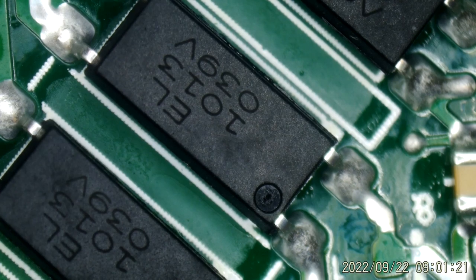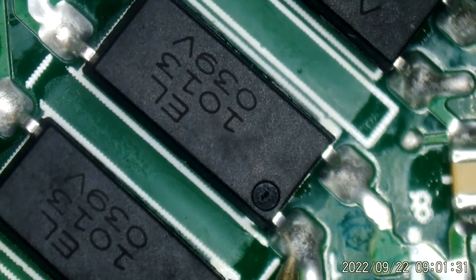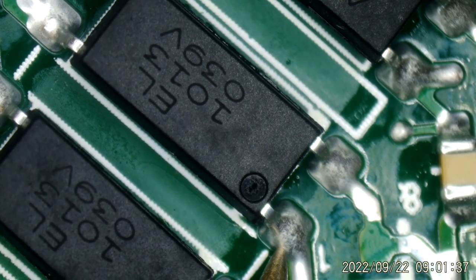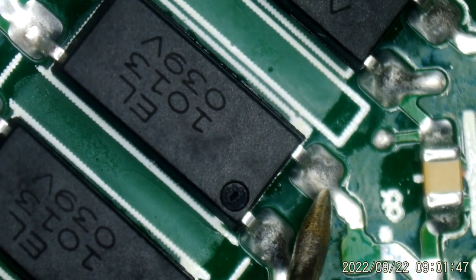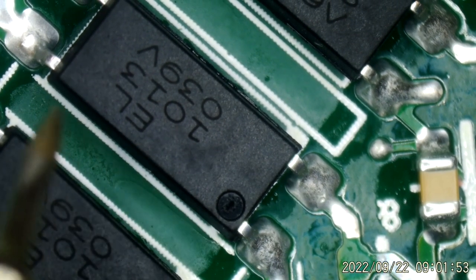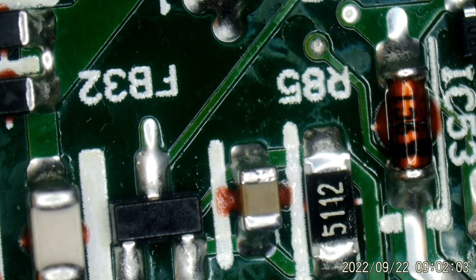All right, IC 53. And one. Is climbing. It's supposed to be like 1.49. Alright, it is finally, there's a capacitor involved there. It's finally settled on 1.49. That looks right. Pin 2, 0.629. That looks right. Okay. On the other side. Get the appropriate ground.